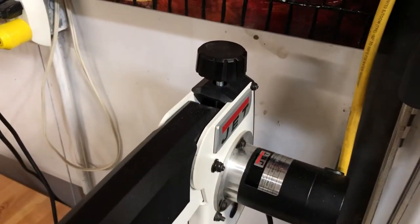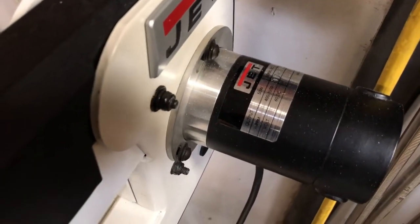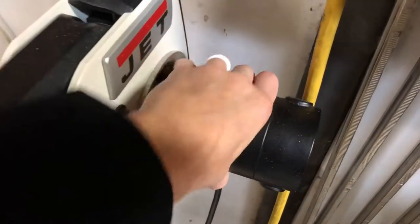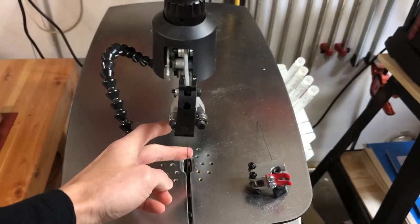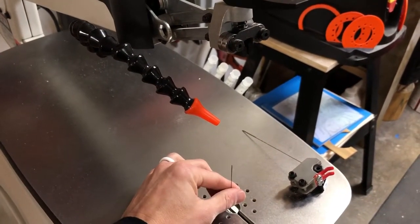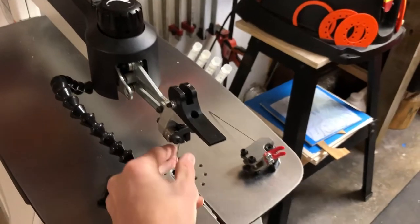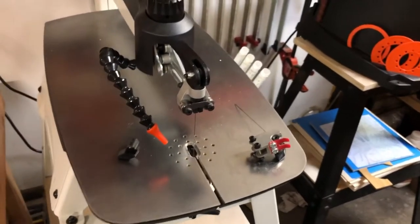There's also a rear arm adjustment on the saw. You can adjust the pitch of your bottom blade by loosening screws and then twisting the motor. This particular type of saw is a bottom feeder, meaning the bottom of the blade is held in and the top uses the clamp, so top feeders may not like this setup. Pegasus does make a replacement top clamping mechanism similar to the traditional ones you'd see on Excalibur saws, which enables top feeding.